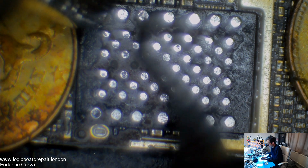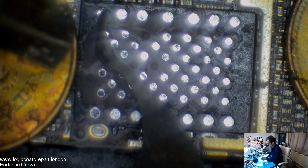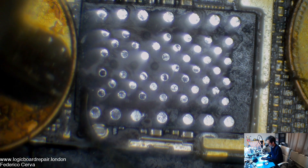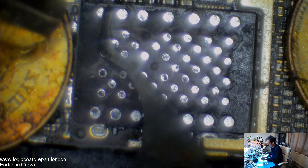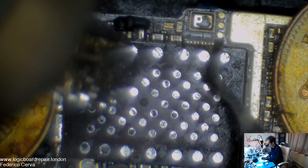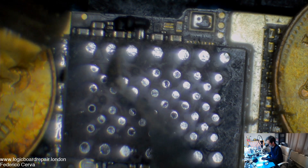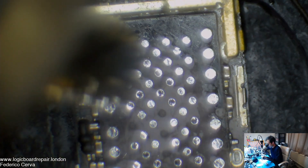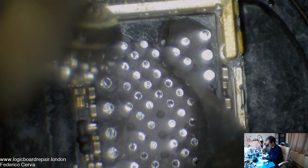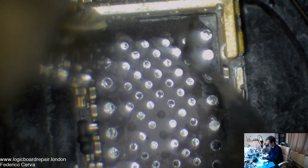So we're getting into the cleaning process, and all you're going to do is literally just slide, just glide. When you're at your cleaning temperature, you just got to glide — not even pushing hard, you just glide. I remember doing this with a blade in the beginning, but as soon as I found this tool, wow, it just changed everything. You can change the angle you're at, get in there, and just come in and glide. Change the angle up a little bit because we're getting in the corners. This tool really does help you not scratch the board once you've found your way with it.